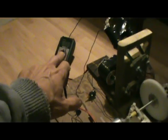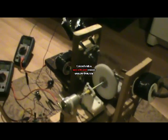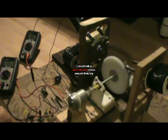Or, you know, your output eventually is gonna, now I could turn this down. I could turn the PMH down and get the AC, or wait, I could turn the input down and let the AC volts drop to their original voltage before I engage the coils, and then flip all these switches all at once, disengage the coils from the load, and the wheel will almost stop. So I mean, just this really crappy setup right here with lots of losses, bearings, there's frictions, there's everything. It's garbage, and it's made out of garbage. But that's where I'm going with this.